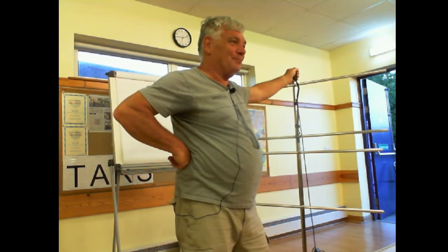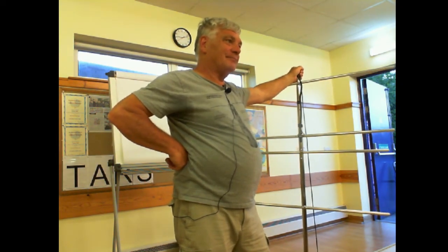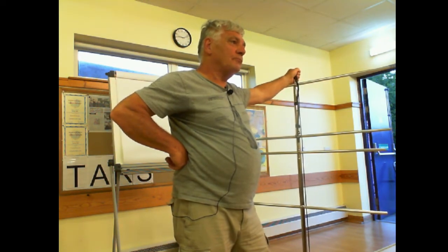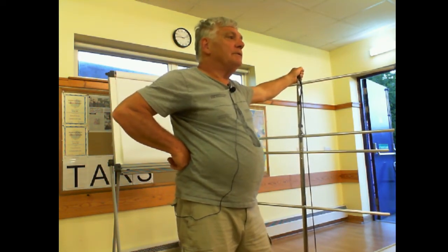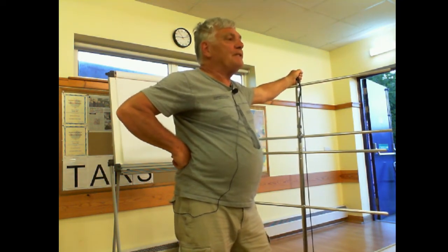Remember I brought in that radiating element of the 2 metre a couple of weeks back, didn't I? And that had a funny thing, it was like a loop. It wasn't an open-ended end, it was a loop, and it connected one side of the aerial to the other side of the aerial. It was a strange arrangement, and I couldn't understand it because, as you say, don't use DC. I used DC to try and it was all over the place. The loop is probably adding phase.